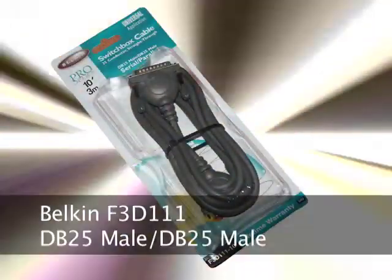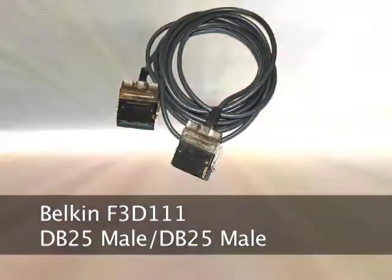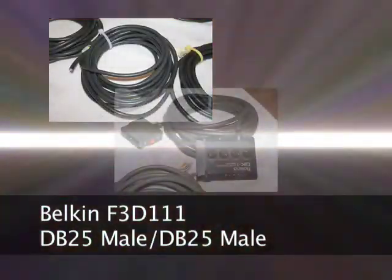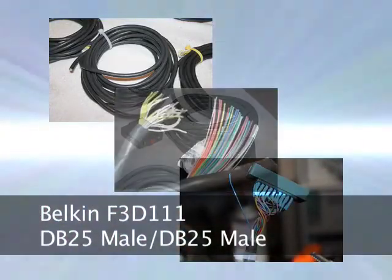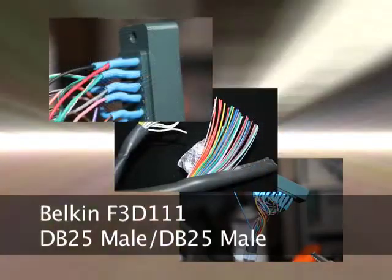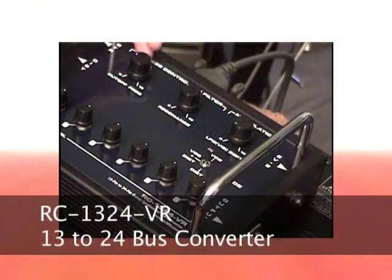A little history: I have been using 25-conductor Belkin F3D111 wire as a replacement for the original Megami cable when rebuilding vintage Roland cables for a decade. I believe this is a higher quality cable than the original. The Belkin cable is data-grade with shielding, which the original Megami cable did not have, plus a dedicated ground wire and one spare conductor in case of failure. None of the cables rebuilt with Belkin wire have had any failures.